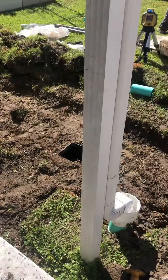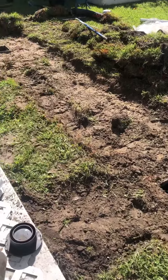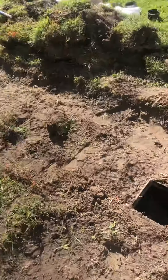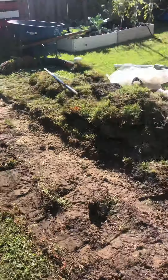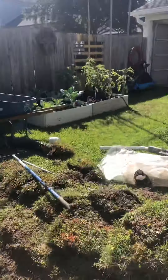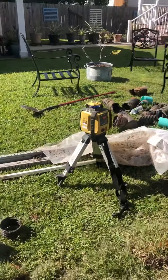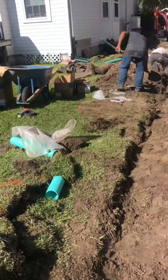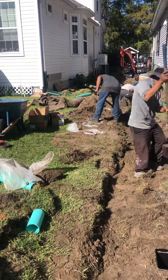We will also do some grading over here where we're going to add some sand and slope from the top of the carport to the drain. The drains are a few inches below the carport. On all drainage jobs we do use a laser level to make sure it is sloped properly. If your contractor does not use a laser level, it will not be right.